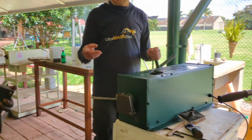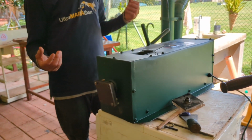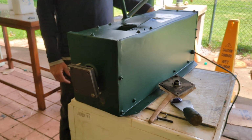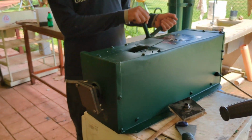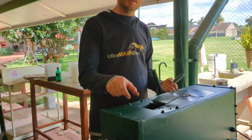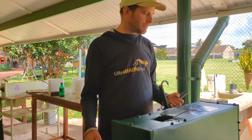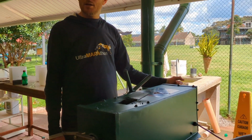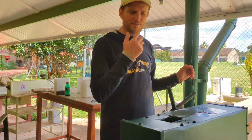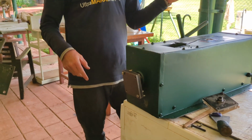Okay, really quickly, just as Bernard is taking out the mold, some basic troubleshooting things. Obviously, make sure your temperature is correct as you do it. If you feel resistance, like if you feel it turning and nothing's coming out, it usually means that there's some plastic that hasn't fully melted in there and is jamming it. One way to troubleshoot is just to raise the temperature, and that makes sure everything melts, and then give it some time. Just be patient. Eventually, it'll melt, and then you can usually get rid of any excess plastic, and that'll clean the shaft.